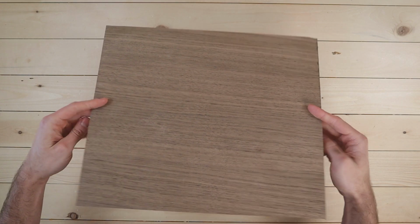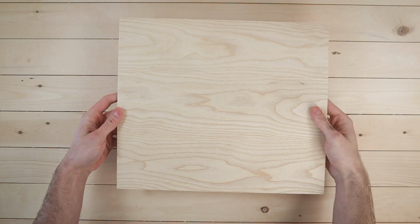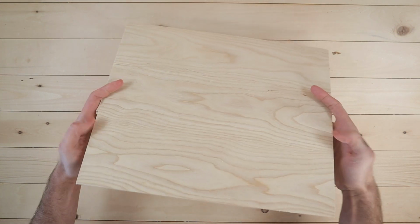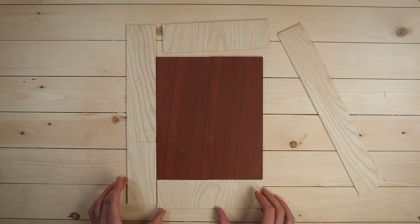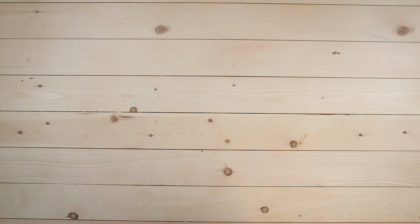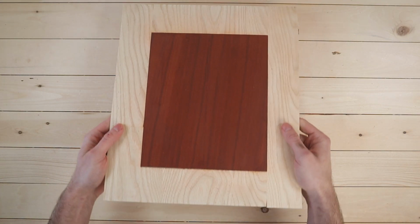Once that glue dries, you've got yourself a beautiful ply of 1/8 inch walnut. Then do it again with the ash till you've got enough thickness for the whole shield. I ended up with 5 sheets total, coming in at a finished thickness of, you guessed it, 5/8. Now for that bloodwood. I wanted to be able to carve out the shield symbol and reveal redwood underneath, so I made up a sneaky hidden bloodwood ply. It's got an ash border so that from the sides it'll look normal, and you'll only be able to see the red from the front.